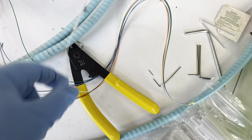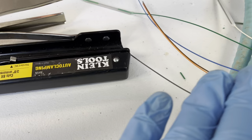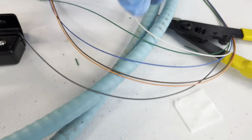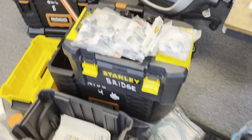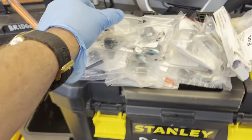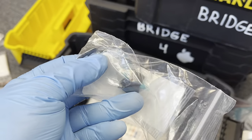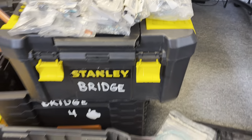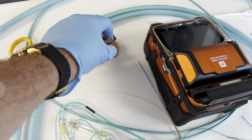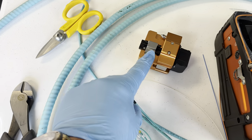Inside are just the regular fiber strands — very thin. Once you get to the point where you take these out, there are two different kinds of connections you can use: a fiber optic splicer, or what most of the older guys use — heads. I like the AFL fast connects. To get the fiber on these heads, you can use no-name cleavers. We have all kinds of different cleavers here — this is like a $25 one.